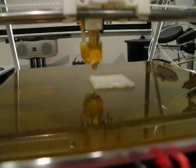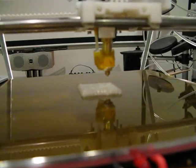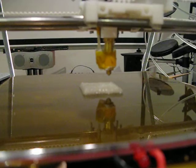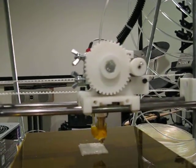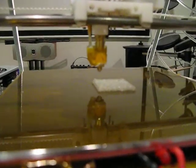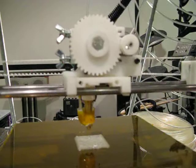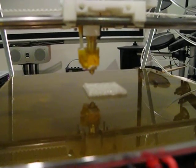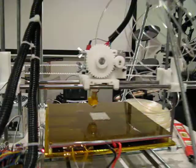Here's something interesting — you'll notice it's currently not printing anything, which is a problem. I'm still messing around with settings and I think I went too far with one of them. It's retracting the filament back into the extruder to prevent stringing as it moves between columns on the corners of the pyramid, but clearly it's retracting too far, so no material is coming out. I'll have to go back and change the settings yet again.